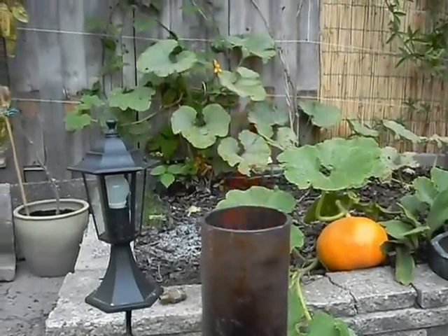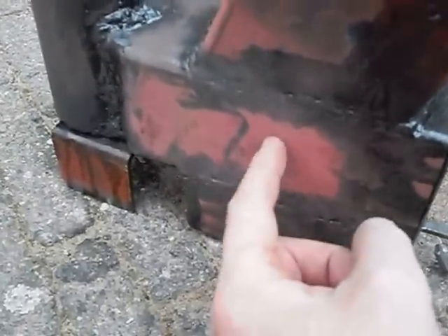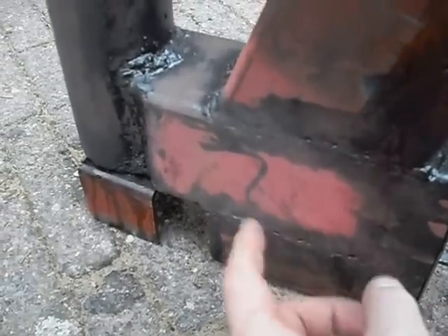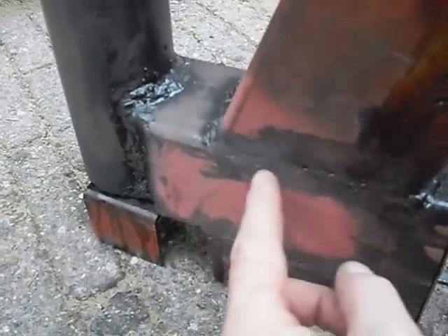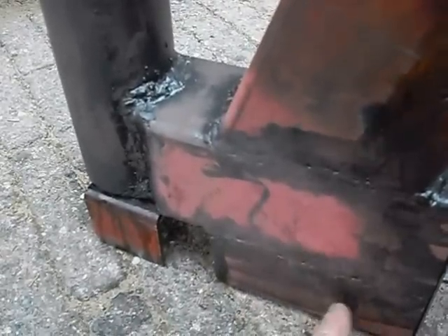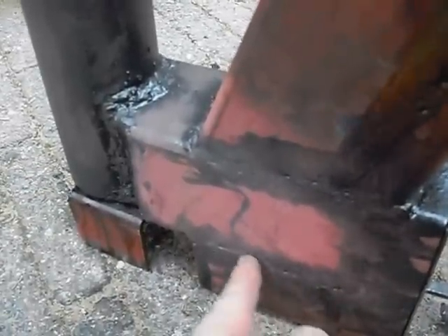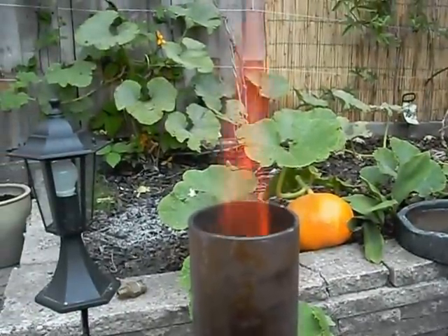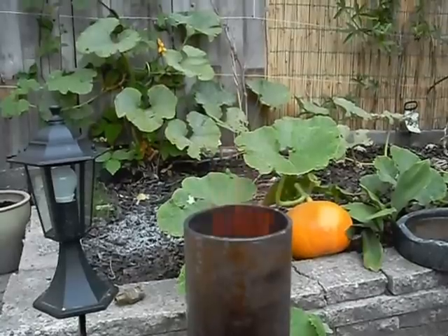Within a few seconds this works. Pretty cool, eh? I've got an ash tray on here with a system to catch ash. It's open with bars, so the fire burns here, ashes fall down, air comes through here but can also come under here. And that's why it burns like crazy — uses very little wood, gives off tremendous heat.